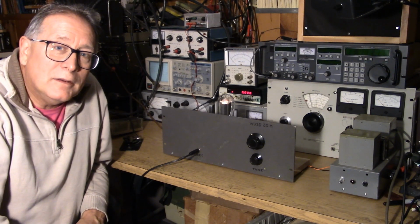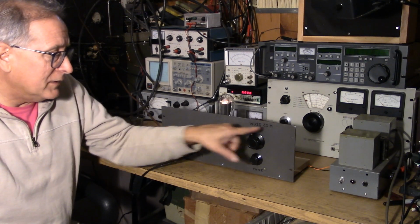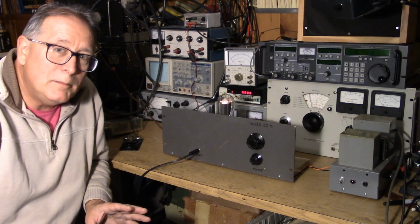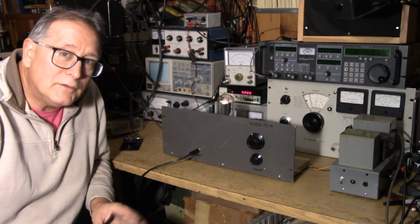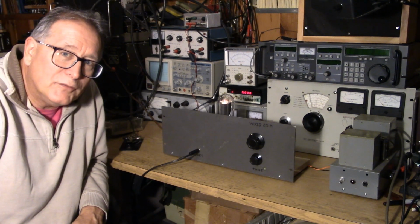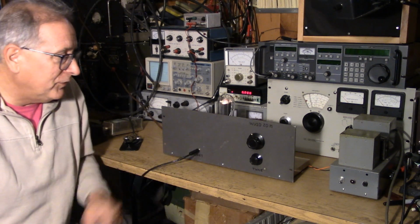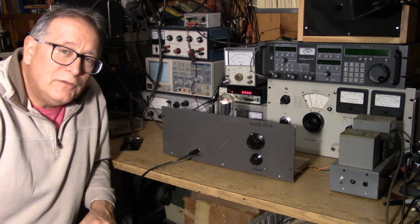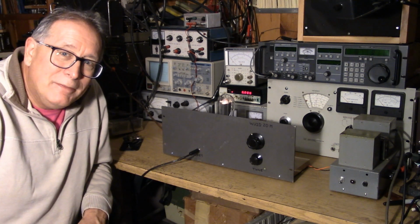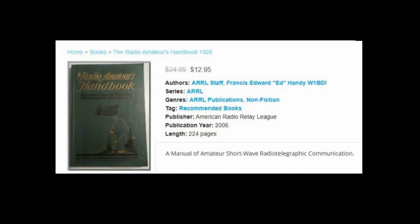So this oscillator on 20 meters, of course, it's very difficult to make an oscillator stable on 20 meters, even if it's 10 milliwatts, much less a 10-watt output power oscillator. This device really goes. So we'll take a close look at this circuit and see if we can make a stable 20-meter transmitter that we can put on the bands without causing mayhem.